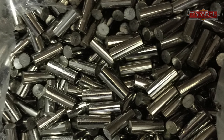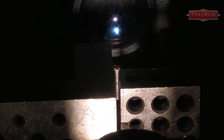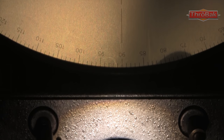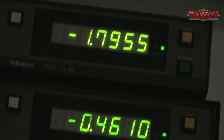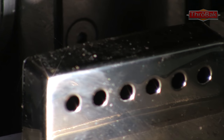They actually tried to sell me one of these machines, but they're so big there's no way. This is a pole screw — a vintage pole screw — that I took some measurements from, actually had Fred do it at his place with an optical comparator. This is how the screw place did it for the reproduction screws they make for us — taking very precise measurements. I just wanted to double-check the measurements with Fred's setup to make sure everything's going to fit together. You can take very precise measurements from an original part with an optical comparator.